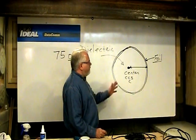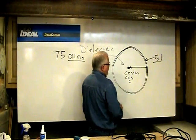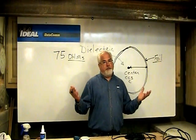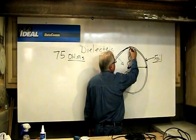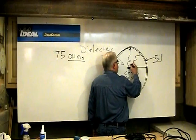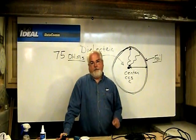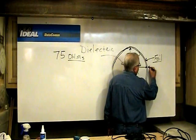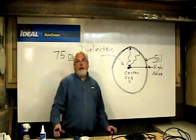That's the purpose of the dielectric. The foil has a couple of purposes — it's basically aluminum foil wrapped around the wire. The center conductor radiates a magnetic field at very low power, and that field tries to exit the cable. The foil diverts it back to the center conductor, helping keep the signal on the wire. The other purpose of the foil is to keep outside interference out — specifically high-frequency noise, meaning RF signals from radio stations, TV stations, airports, anything that broadcasts RF energy into the air.